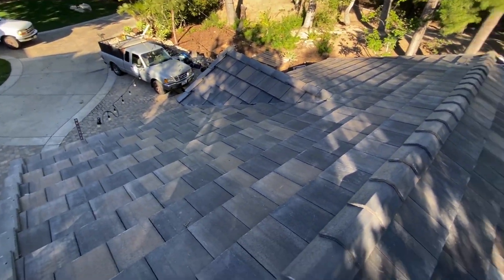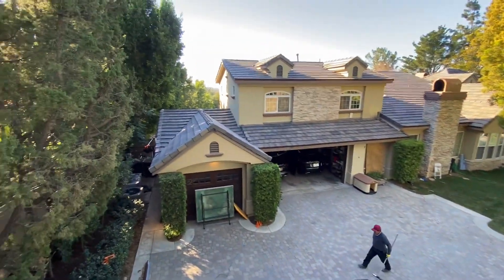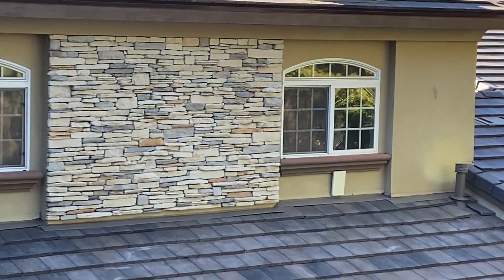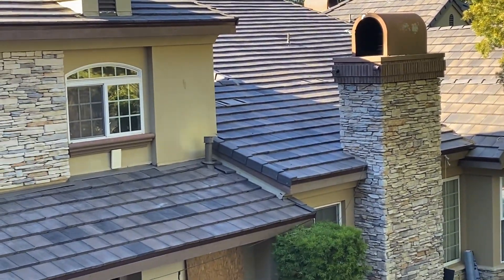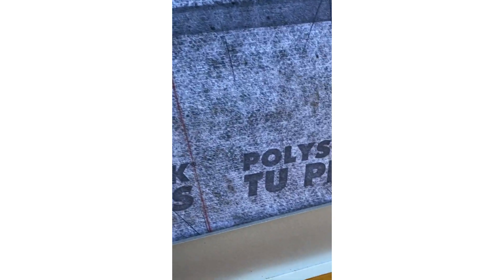I'm done with the guest house. I put two hanging vents and the tile is done. Tomorrow I'm going to do the two little roofs in the back. For guys who don't know: make sure your tile overlaps at least three inches onto the bottom one. So if your tile is 17 inches long, you mark your lines at 14 inches. Also, this is my peel-and-stick underlayment, and this is the synthetic underlayment they originally installed — I put my underlayment directly over the synthetic underlayment.